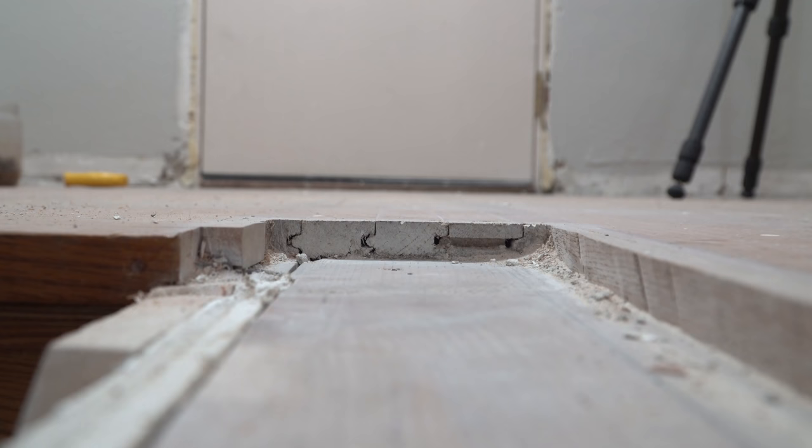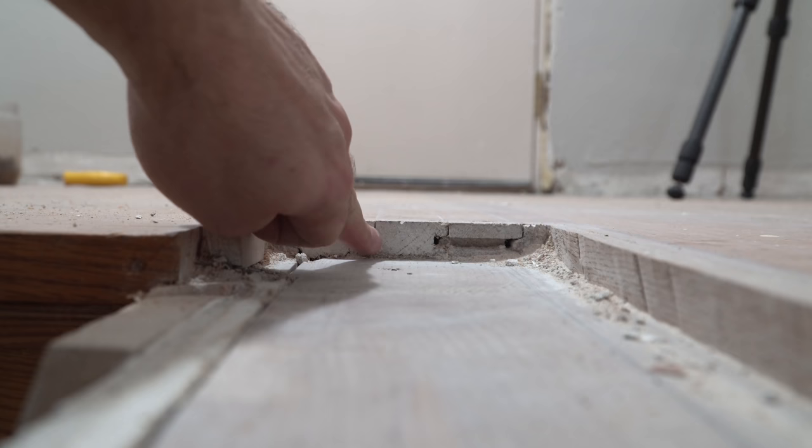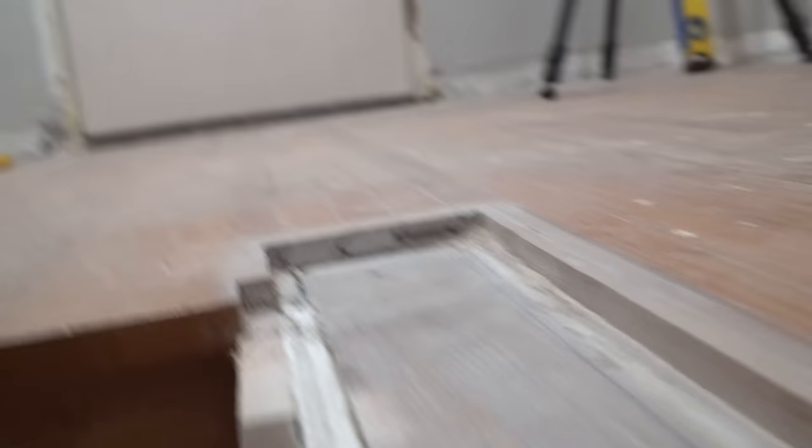Looking this way at the uphill side of the staircase you can see which direction the tongue and groove floor slats are going. We've got the tongue pointing that way and the groove pointing that way. So to get it out we have to figure out where the nails are. Now they would have blind nailed most of this, and I'm assuming that they went in this direction and hid the nails inside the grooves.